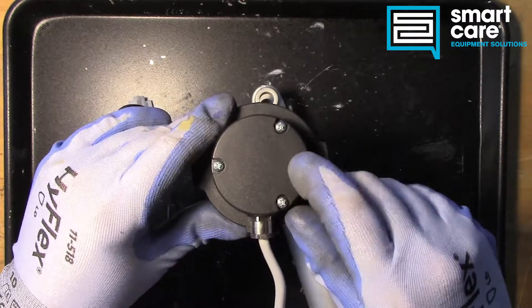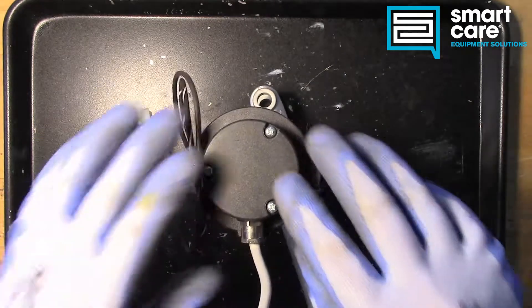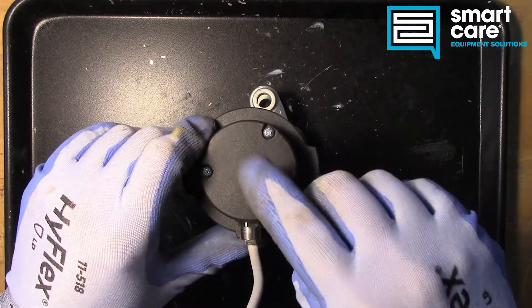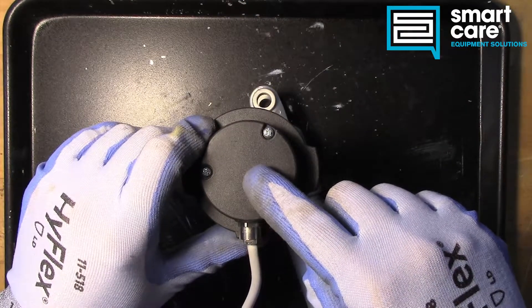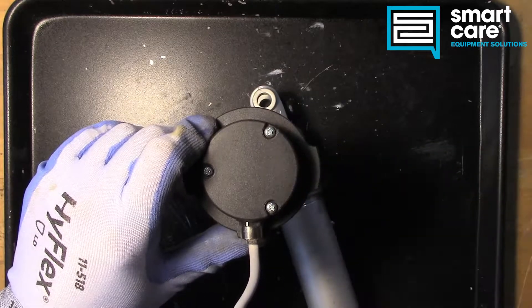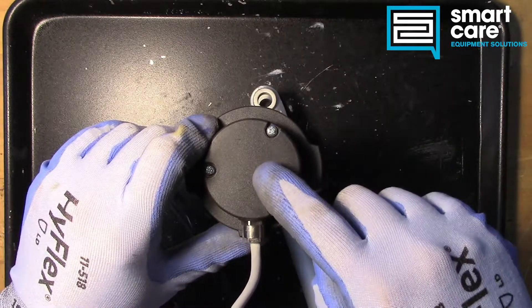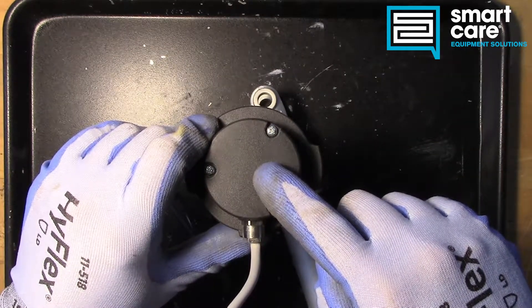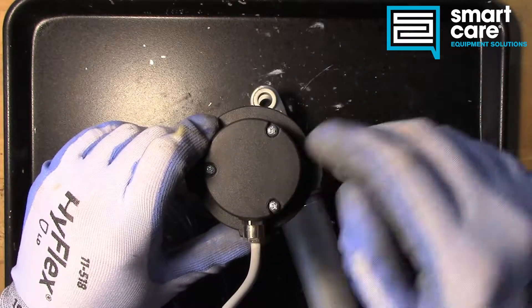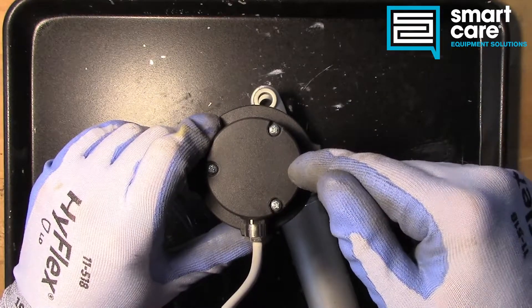This end piece is called an encoder. As this device runs, the encoder is plugged back into the control system and it's reporting back to the control system how far the device moved. Typically they report in a sequence of pulses — it'll tell the control how many pulses it picked up. So I'll be really interested to see what this looks like inside.